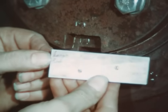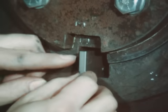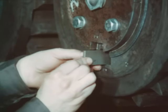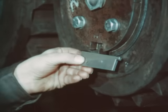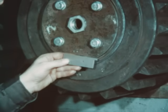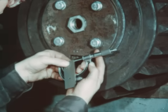Another method of measuring the height and taper of the keyway is by using an altered adjustable parallel. The parallel has been machined to a taper of one-eighth inch per foot. Insert the parallel and position it until it is a tight fit at the outermost end of the keyway. Remove the parallel and with a micrometer, measure the large end.